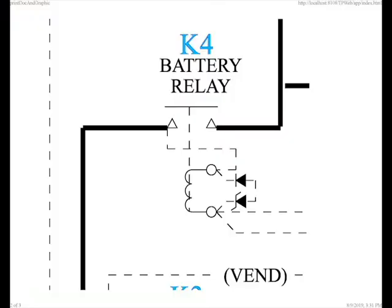So what are these magic relays? Picture in your mind a big T made of copper. Under the T is a spring pushing it up. We wrap wires around the base of the T, and then when we pass a small amount of electricity through those wires, the wires will then turn into an electromagnet that pulls the T down against the spring. This makes the two arms of the T touch large copper contacts.